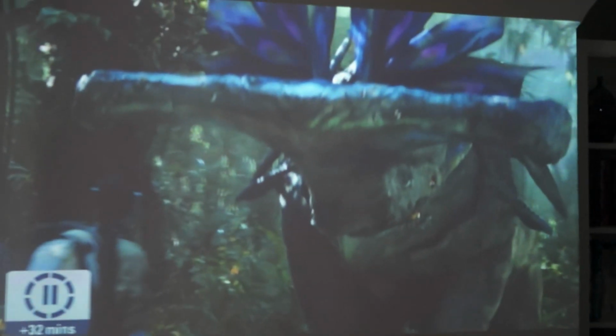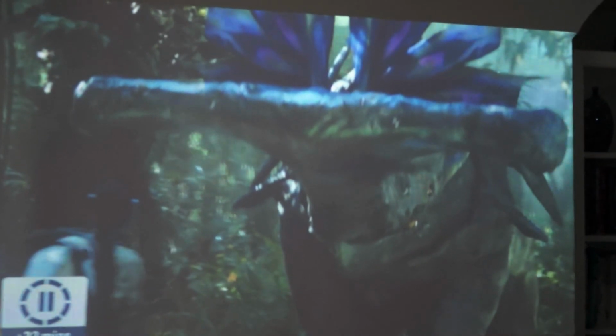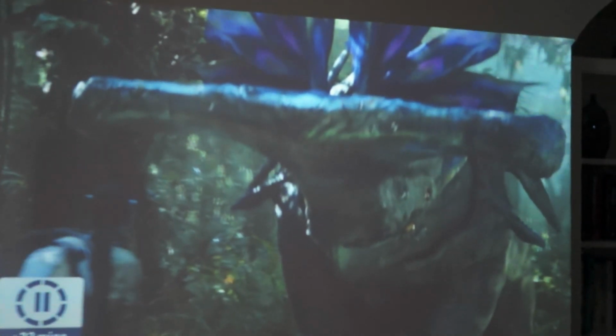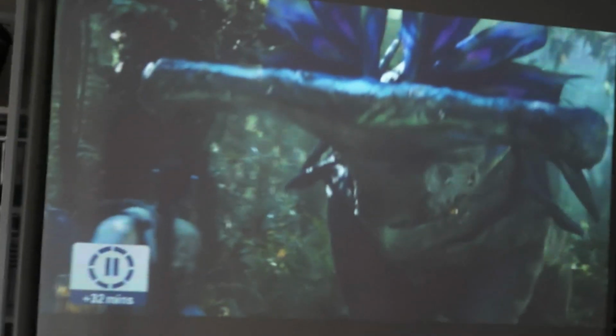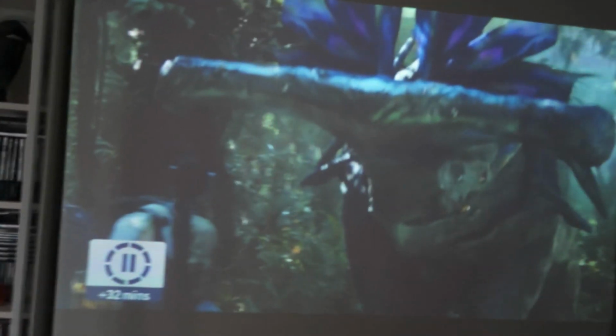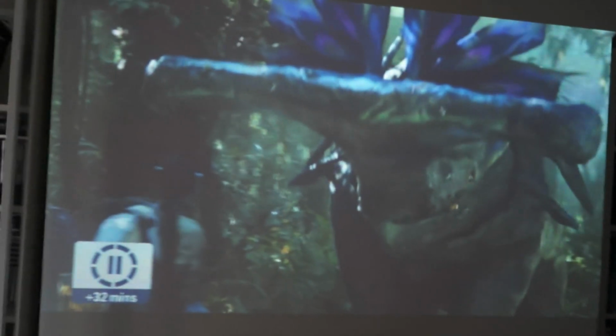Okay, so I'm guessing if there's any real information to be had from this, it is that you really have to upgrade these cables, because they have to be 1.4s, certainly from the source to the unit, but I would also say from the unit to the projector. Before I did that, I had terrible red flaring on the screen, and to be honest, I was blaming the box or things, and it was all down to the cabling.